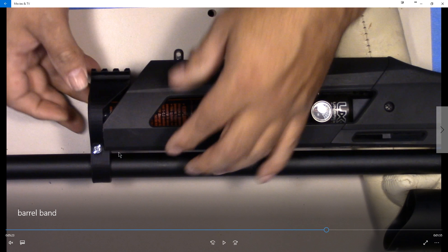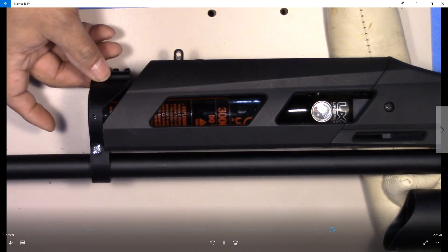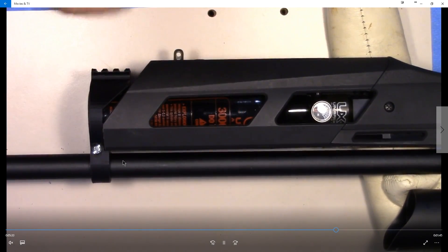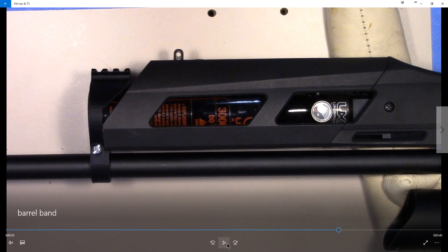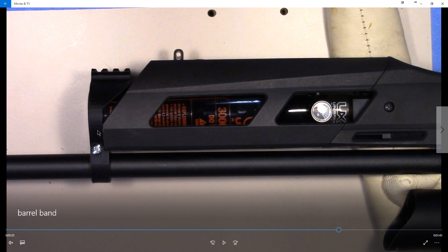So I took the shoulder out of the way so you have about 3/16ths of an inch gap of movement before anything touches the barrel. Once it's slid over and lined up, notice how I'm tapping it so that it's loose — you don't want to introduce any twisting to the barrel. You want to sight your weapon in first, get your point of impact at like 20 yards. Then when you put this piece on and tighten it, be very careful not to twist it, because twisting will cause the point of aim to change. I deliberately used a long screwdriver so you can see I'm not putting a bunch of pressure on this.